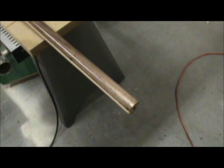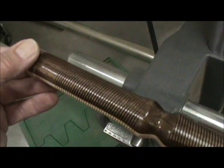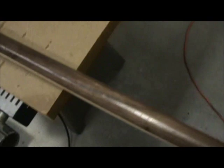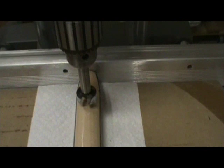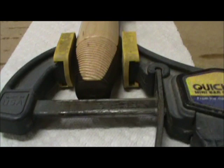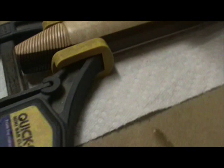I'm nearing the end. I've put three coats of polyurethane and finished it off with one coat of high-speed friction polish — it came out very nice. I parted the end off; this end up here is going to be the top and it will fit inside the top part of the cane so you won't see it. I had to get the finish off it so it would provide a good glue surface. I've got it set up on the drill press, measured to be in the center of the highest part of the handle — right in the dead center. All there's left to do is drill the hole and glue the apparatus together.